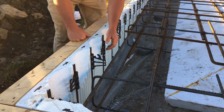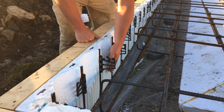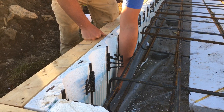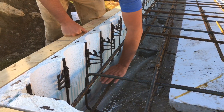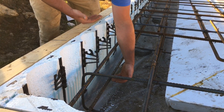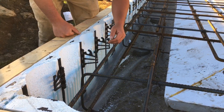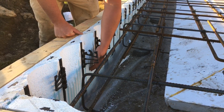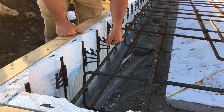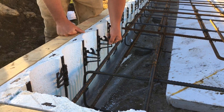Here's a better shot of the ICF block. It's actually ran down past the gravel — we had the formwork and the blocks in place first, then we set our gravel up against it. That allowed me to get the full 18-inch height of the ICF block, the Adura block. These ribs allow it to bond to the concrete, and these are the snap ties that we cut — they'll help bond better.